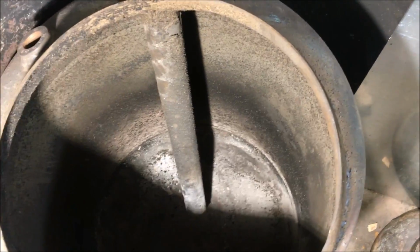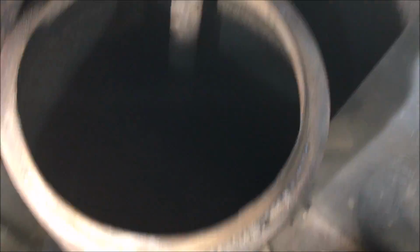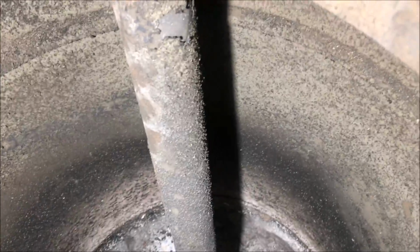But still, the advantage of that Cyclone is that it increases the residence time of the smoke. The smoke does somewhat of a swirl in there. It gives it more time to burn. It's a far cleaner burn. This thing burns horribly. It's a very sooty, foul combustion. I mean, look at the buildup on this thing. It's only had about 20 fires in it.